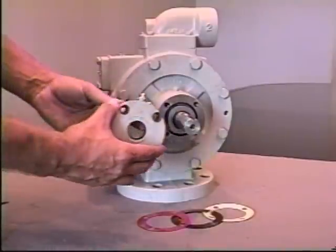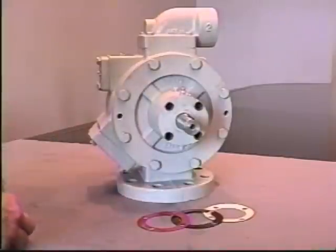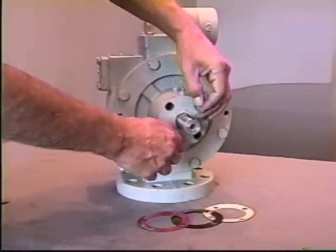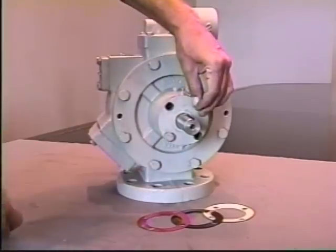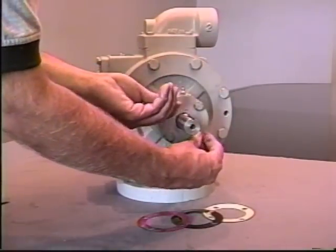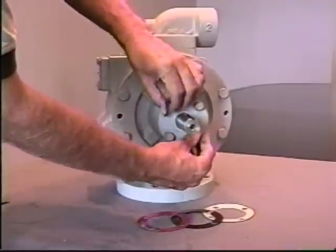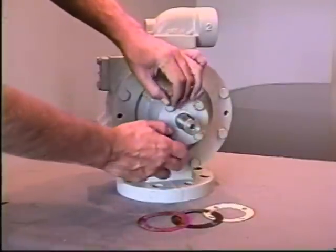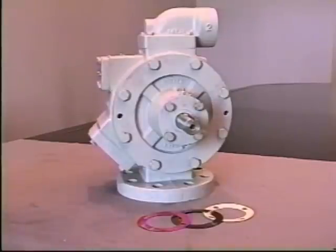and installing the bearing cap with no shims installed over the shaft, and bolting down just with light finger pressure. After the bolts have been installed, you then check the clearance between the bearing cap and the main head. On the first side, you would check what the clearance is and add a total of 6 thousandths. On the second side, you would check the bearing clearance and add a total of 2 thousandths. So in this case, it is the second side.